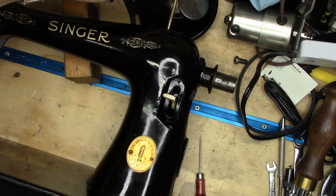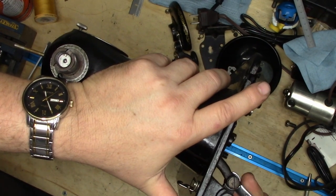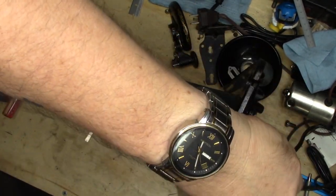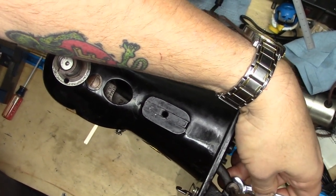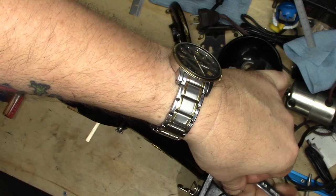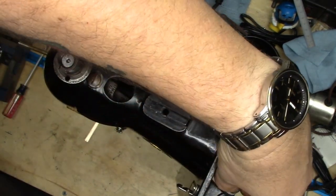We'll lift off the plate. As you've seen in the earlier videos, there's a nut on the back of this eccentric bolt that we need to get off in order to remove the bolt. This one's about three-eighths of an inch. I've got it loosened. I'm sorry there really is no good way for me to do this without getting my hands somewhat in the way — the nut's obviously on the other side. I'm a one-man operation here; I don't have the luxury of a film crew.